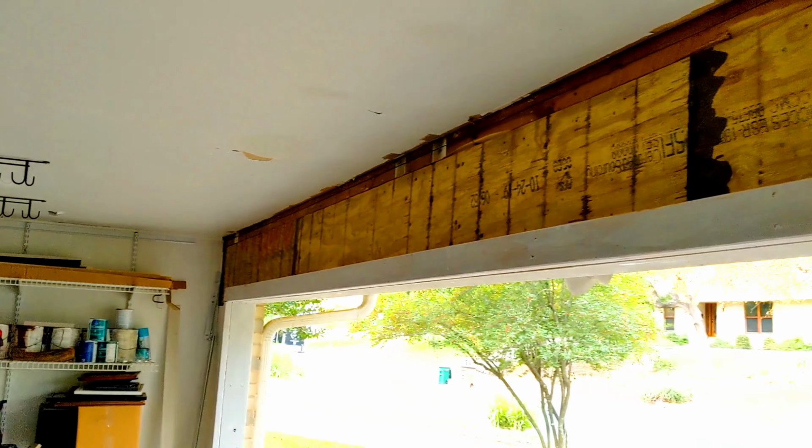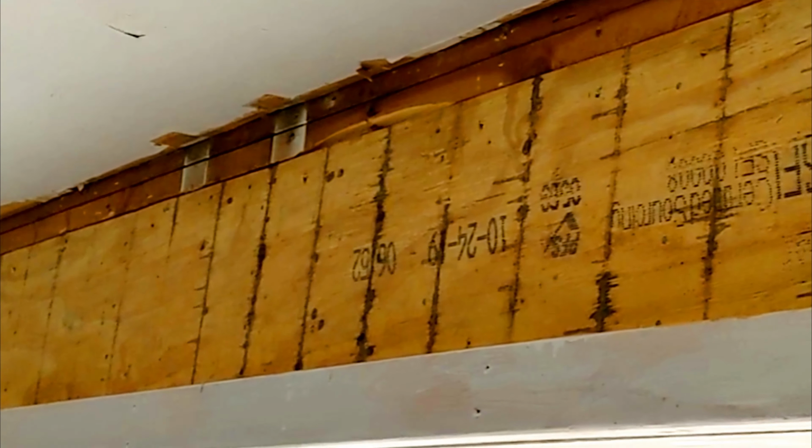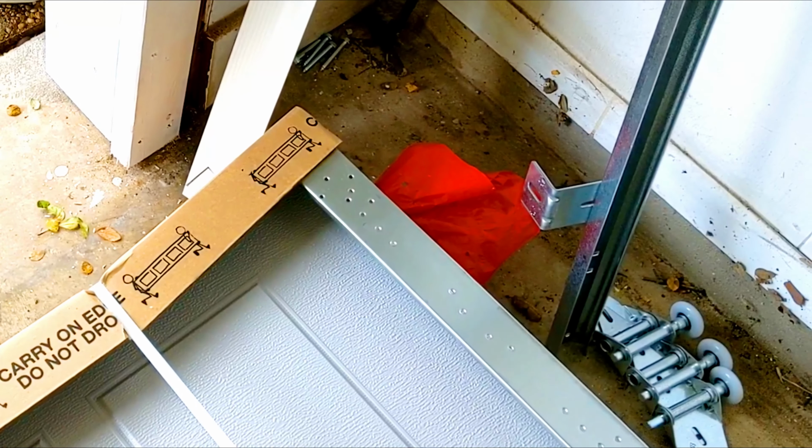But once I get the door all stacked in, I'm gonna have to put in the spring pad right there in the center once I get to that point, for the spring line and for the opener mount. Currently right now I'm gonna get the trim, and we'll get this weather seal up on there around the opening, and we can start stacking in the door.